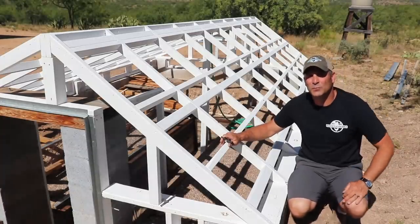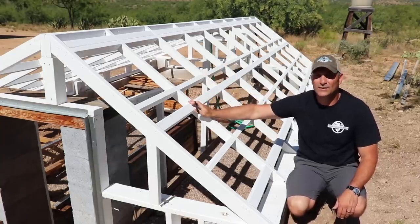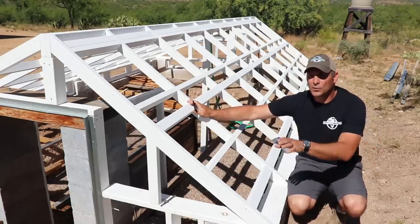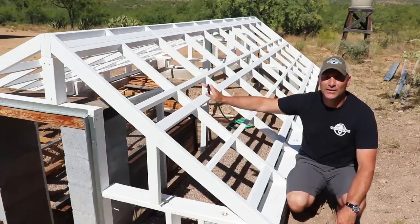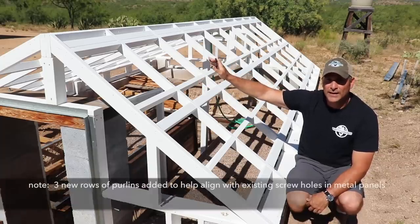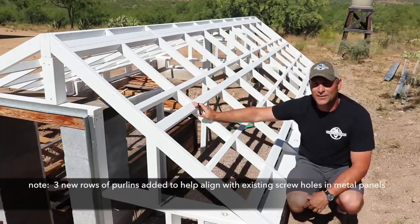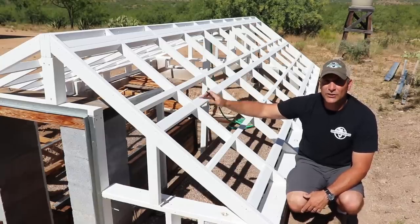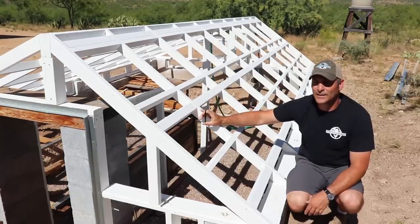The back side of the greenhouse roof will be a completely different story. This is the north side, and I originally had it covered in polycarbonate roofing just like the south side, but in reality it was kind of a waste of material — it doesn't get any sun during winter, spring, or fall when I'd actually be using this. In the middle of summer it gets sun, but being that this is Arizona I never intended to use the greenhouse in summer. So instead I'm going to use corrugated metal roofing that was removed from my house during the hail storm. Some panels have bad dents but I'll use the slightly dented ones. It will allow a little more thermal transition since metal is such a good conductor, but I don't anticipate that being too much of a problem — I can always add foam insulation afterwards.